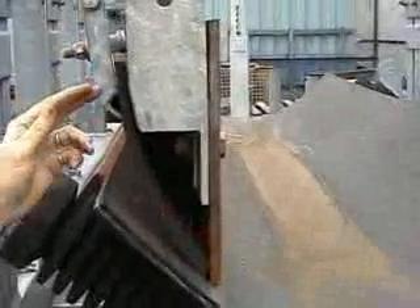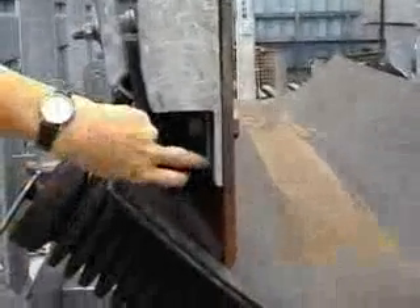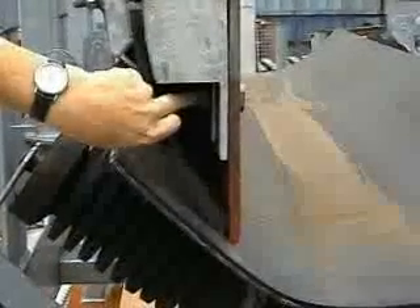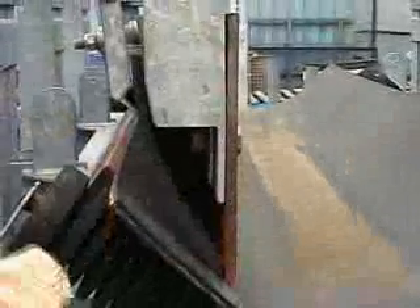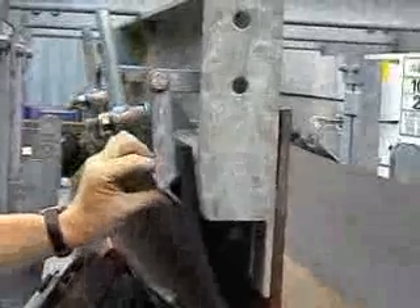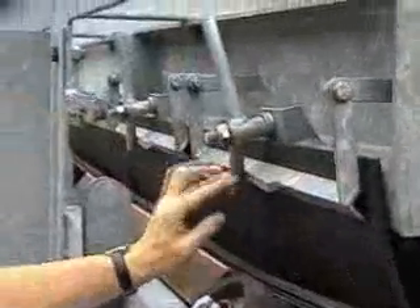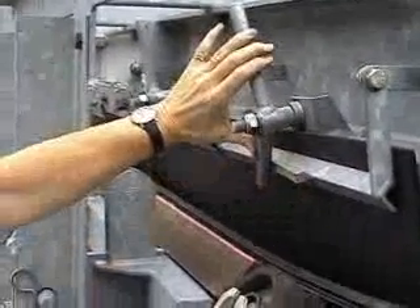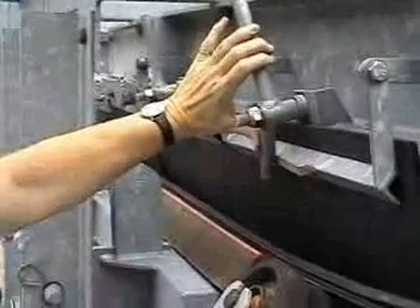It can be 150 by 12 up to 300 by 16 thick rubber. The actual liner adjuster bracket, which is inside here, the liner bolt, and the liner — which is only represented by a mild steel plate here. The actual clamp itself, which is a rotatable clamp, is a small angle which has a wedge welded to the clamp angle itself, and it's held in place by a handle which is rotated around, which we'll show you later in the demonstration.